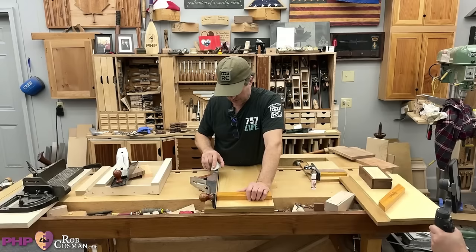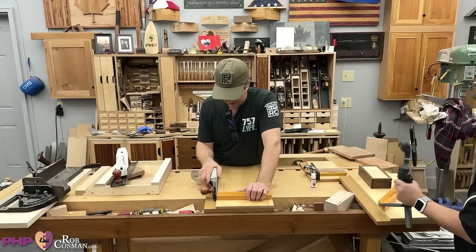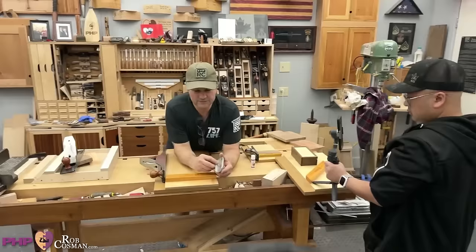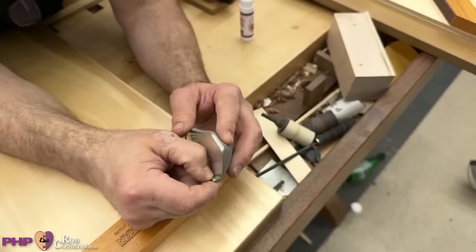I want to be right there where the action is. Okay? It gives you lots of grip, as opposed to trying to wedge your hand down in here. It has two little set screws underneath here. Are you in close enough to see this? It has two little set screws. These are oval set screws. They have an oval tip. And you start the process with your plane by bringing these out a little bit. When I say a little bit, oh, I don't know, maybe three or four thicknesses of a piece of paper.